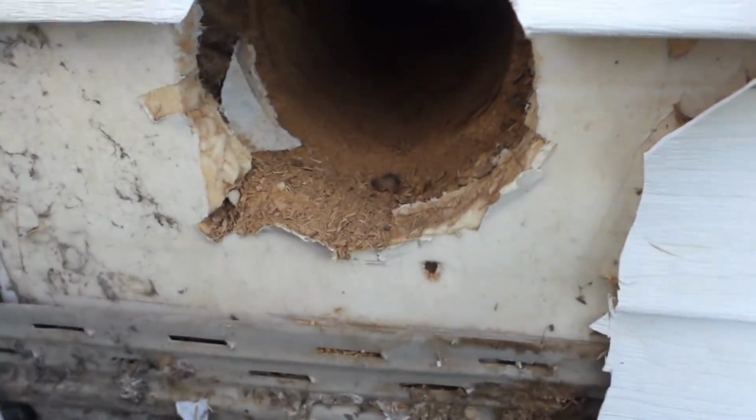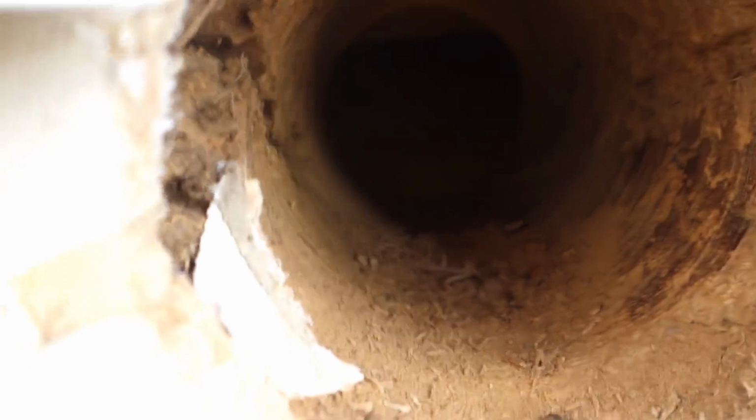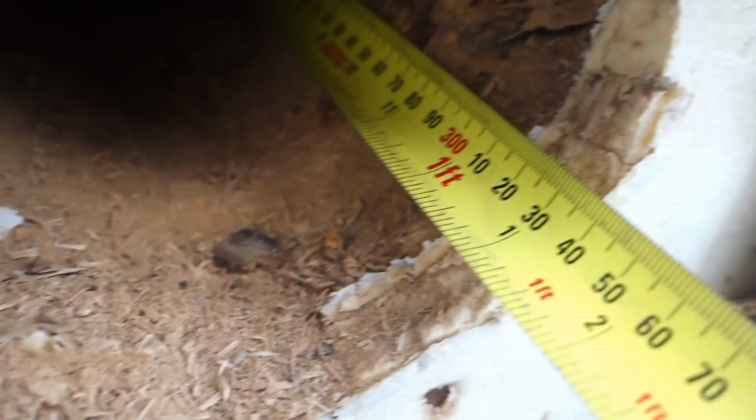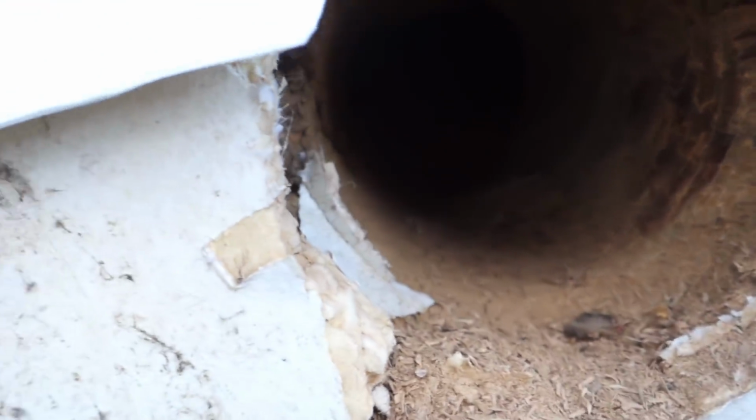Well, I have the pieces inside the house warming up, and I'll show you why I needed to do that. We're looking at 12 inches just on this wood alone, and another 1.5 inches to the siding, just about an inch maybe. So it's time to get this going. Yes, I really did have a 4.5 inch hole saw, which I could have started with in the vinyl siding to get my hole through the vinyl carefully, and then continue on with my 3-tooth hole saw to go through the massive part of the wood.